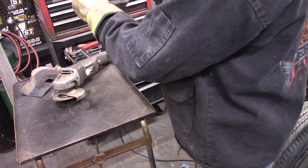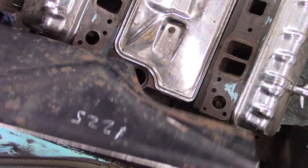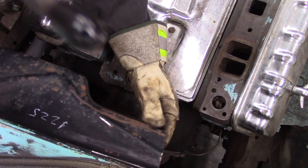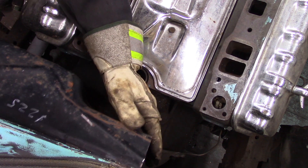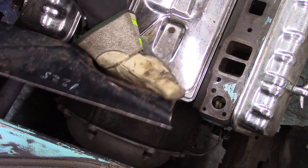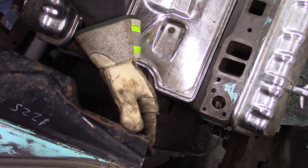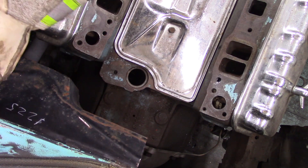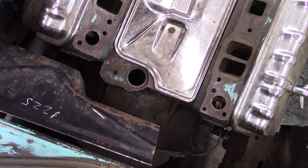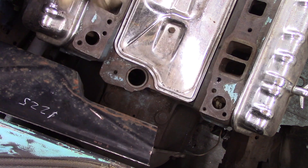You can see what I cut out there. Just like I thought, I'm going to have to open up the hole where the steering column is to get it to drop down some. But you can see the shape of this firewall and how it fits just behind the motor. This is typical with this firewall with a lot of the 50s era overhead valve engines - it's why a lot of guys run this firewall. It's just a really clean modification onto these 33-34 cars.